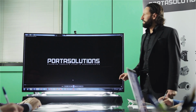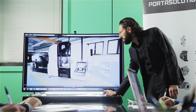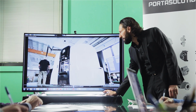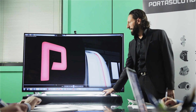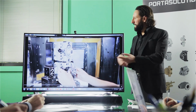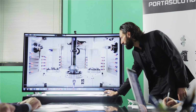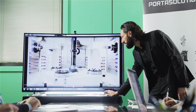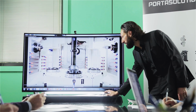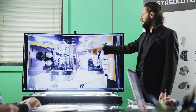The last application, again, is automotive components, where we have A and B clamp. So every time the table indexes, you get one finished part, you move the semi-finished, and you load one rough operation. And we're going to skip the empty and show you. Okay, so a load and unload station and 3 working stations.